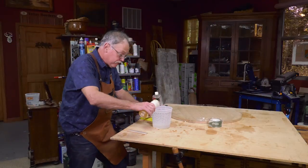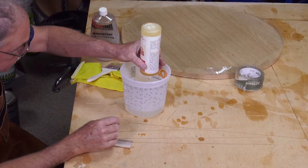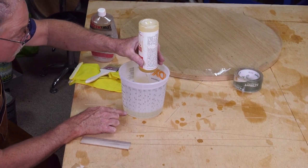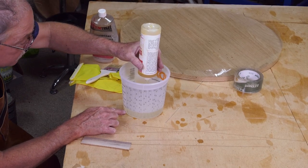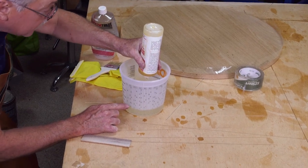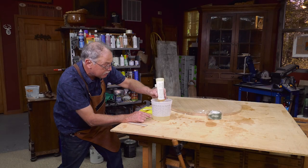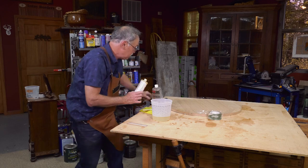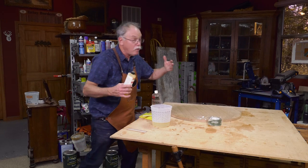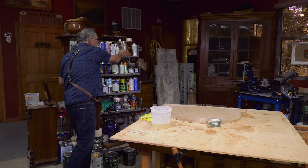When it comes to finishing, a lot of people like to use epoxies now, and I'm just bringing this up to the 2-to-1 mix ratio, two parts of A and one part of B, which is the hardener. And I know right on this mix bucket where that will be. And it's very important to read the directions on this. I'm right there right now, and the mix is correct. Set this aside. No solvents in this, which is great, but I'm always working when I'm finishing in a very well ventilated area. Let me set this up safely.